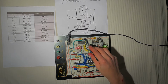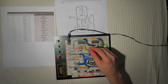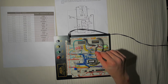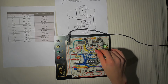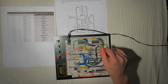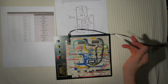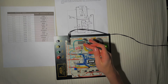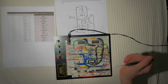Next, these yellow wires dictate the inputs to the multiplexer. So the constant portion of the code comes from the lower nibble of program EEPROM. This is fed into the A inputs of the multiplexer. The B inputs of the multiplexer are the inverted RAM outputs, because the RAM outputs are already inverted, so we'll invert them back. The multiplexer's select pin comes from IO4 of the program EEPROM to select between constant or memory command.